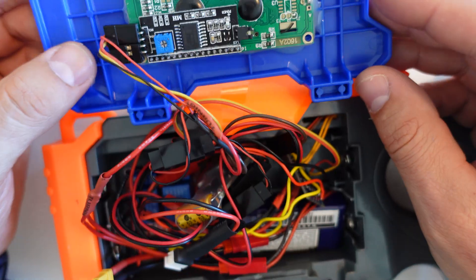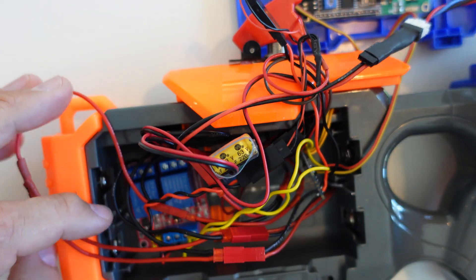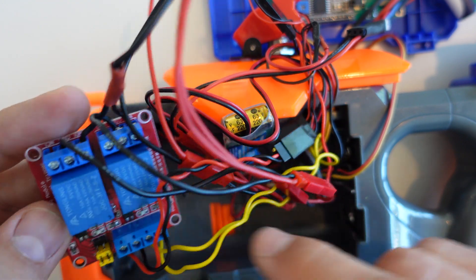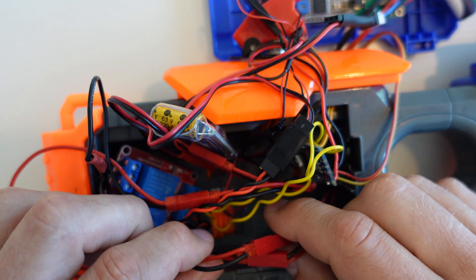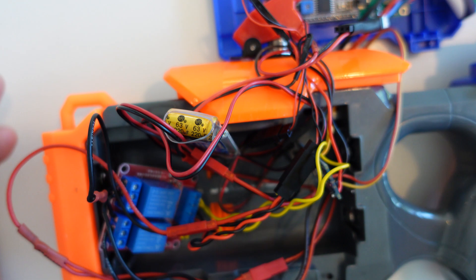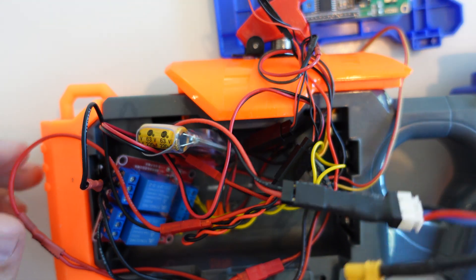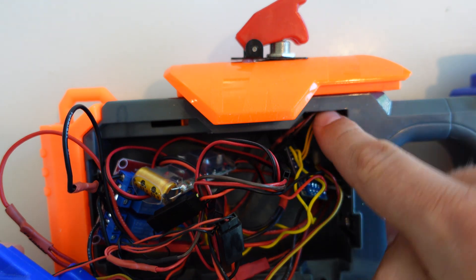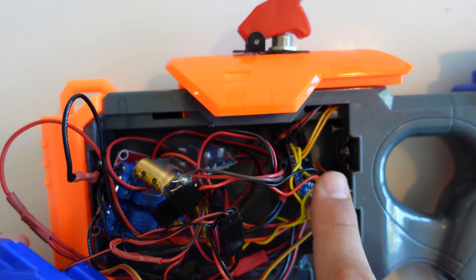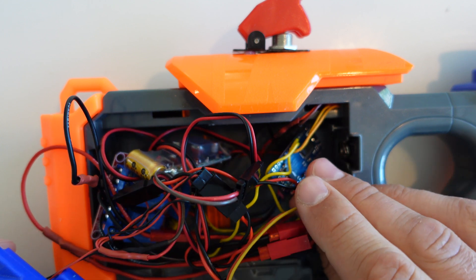Can of worms! So — LCD, backside LCD, battery, relay board, dual relay board, voltage regulator, and the Arduino. I'm using way too many connectors in this build. I thought it was a smart thing to do so I could reuse the components later and didn't have to hard solder things together. I have wires that come out here and here — the ones up here go to the ultrasonic sensor, and the ones here are extension cables that go directly to the motors.